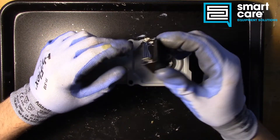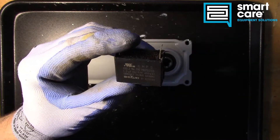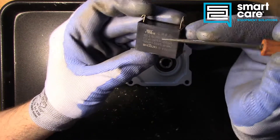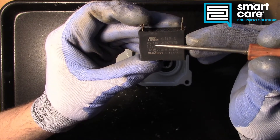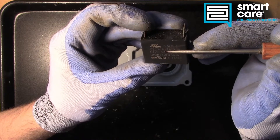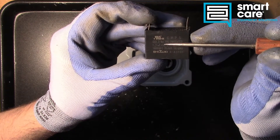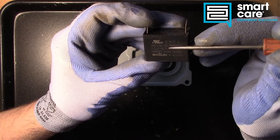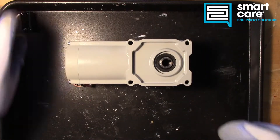There is some shipping damage and some pieces are bent. But first, we have a capacitor, and if we look at the rating tag on the capacitor we can see this is 1.2 microfarad and it looks like it's plus 10 minus 5 percent. So set that off to the side.